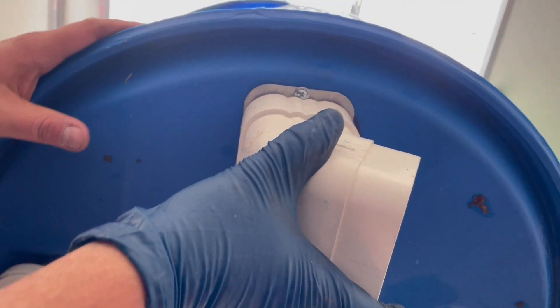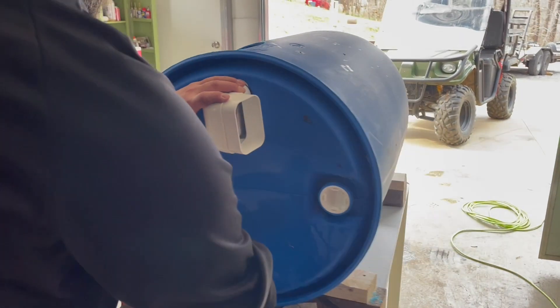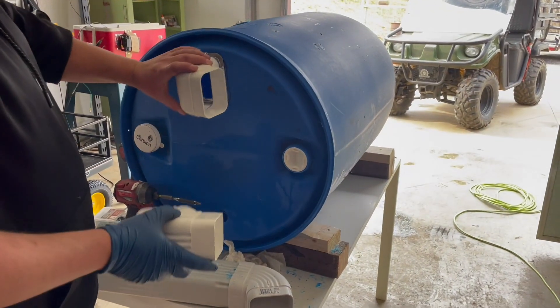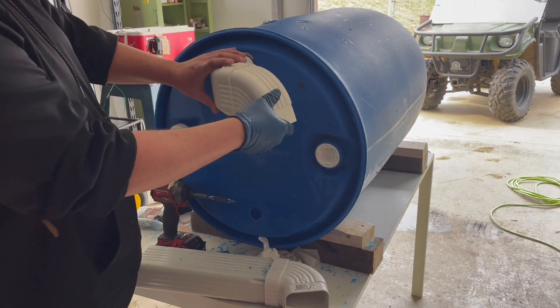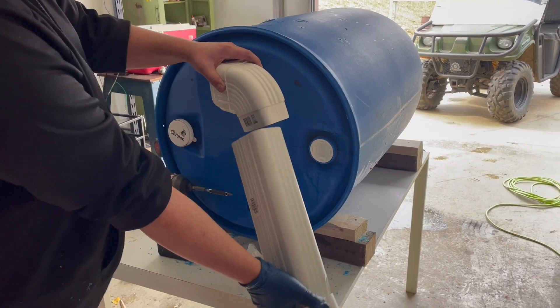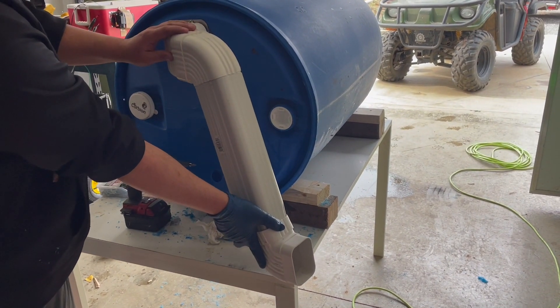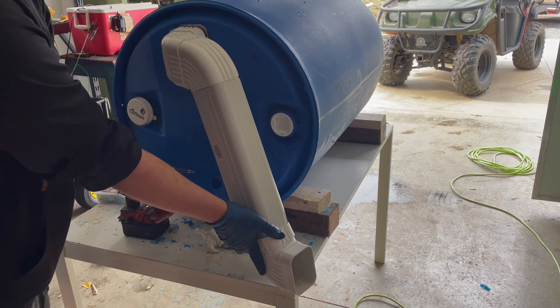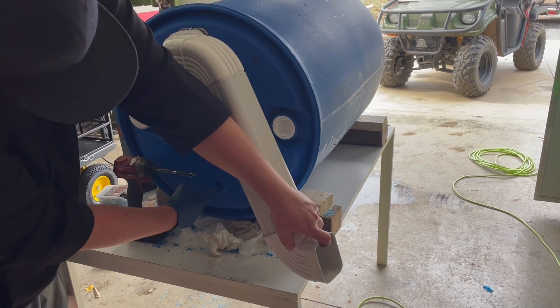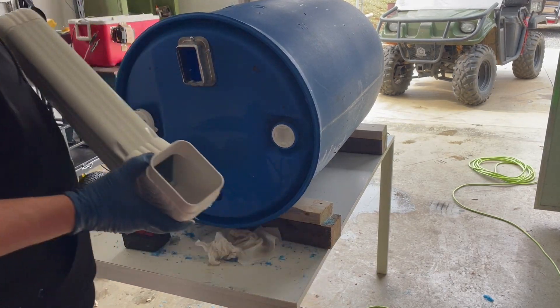At this point I can seal up this gutter fitting with some tubed product, but I'm not going to — I don't care if it leaks a little there. The majority of it's going to discharge right out and down this little gutter assembly I'm building. When you put discharges on this, no matter what your configuration, you don't want to go straight down if your spigot's down there — you don't want to be working behind your spigot to get to the water. So I positioned it to the side to get it out of my way so that the spigot is easy to get to.